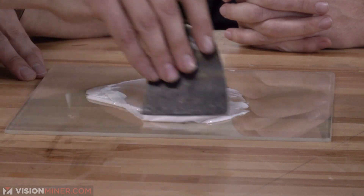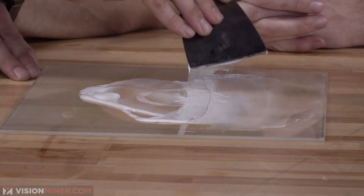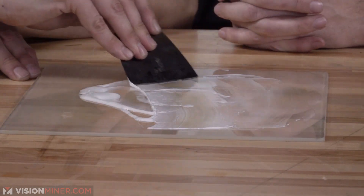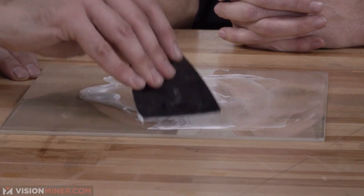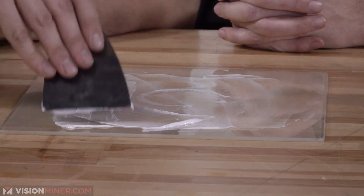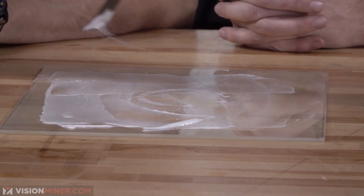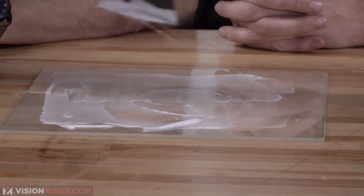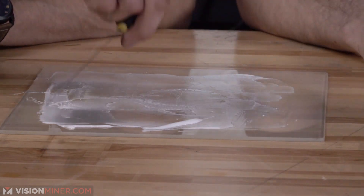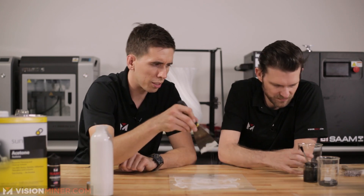Spread it around, filling some gaps. You don't need to go too thick, but you want a nice coating because you need the filament to stick to it later. You need the filament to stick to it. I'm not sure you can actually do this without using a raft, because what a raft does is compensate for an unlevel bed - it just uses a lot more material.